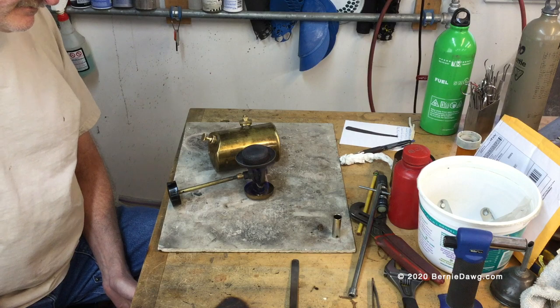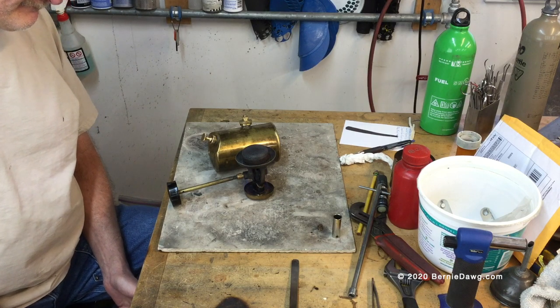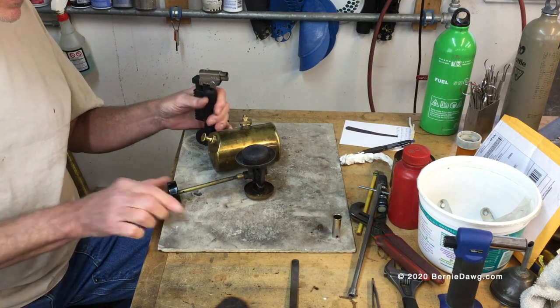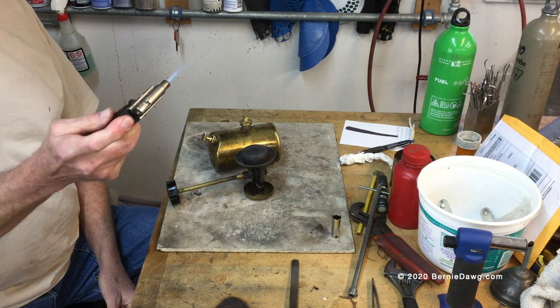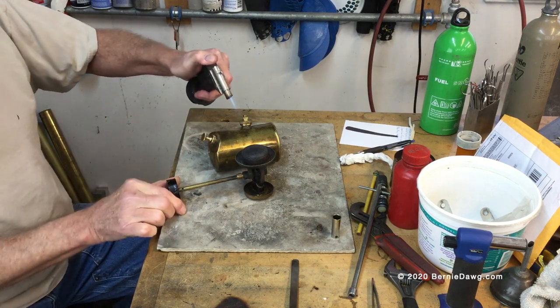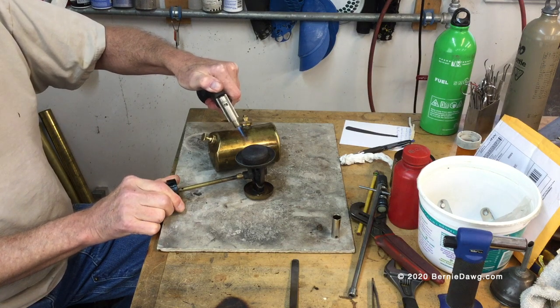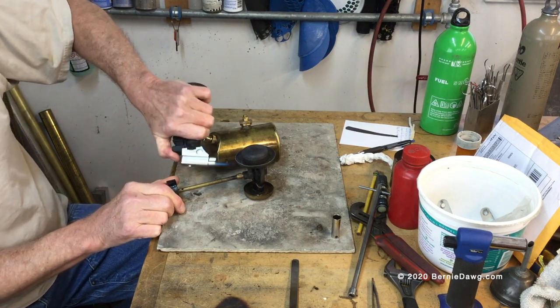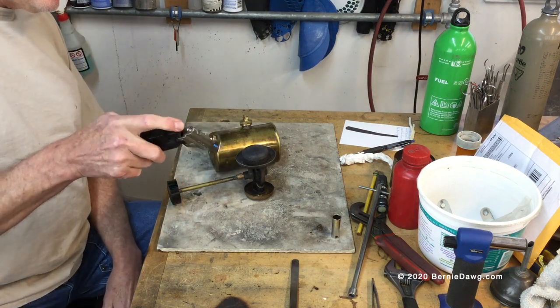What I found with this particular stove setup is that the restrictor tube still had two large holes in it, which allowed too much air and did not allow the flame to light—the mix is simply too lean. Unfortunately, this particular restrictor tube is not going to work with this particular stove. This is the problem when using alcohol, because the range of combustion is very narrow.